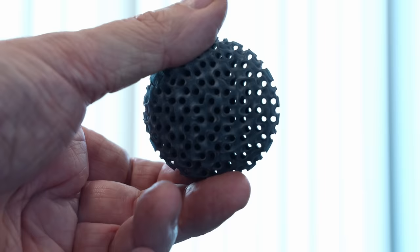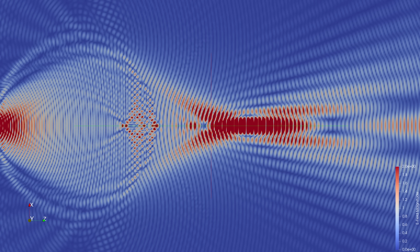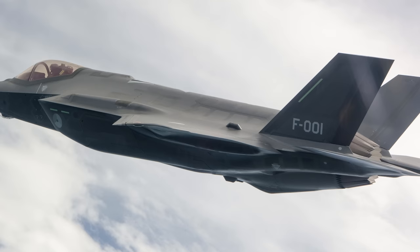The classic example of a lens that's really hard to make using traditional machining is the Luneburg. It's got the remarkable property of being able to focus waves coming from distant sources to a point on the surface of the lens, and vice versa. That means you can put a transmitter at the surface of the ball and it'll be focused in a narrow beam out of the other side. Another remarkable characteristic is that if you coat half of the ball with a reflective metal, any distant radio signal will be reflected straight back in the direction it came from — similar to how high-vis jackets and vehicle registration plates work. Great if you're flying a stealth fighter which is almost invisible on radar into friendly airspace and you want to appear on the air traffic controller's radar screens.